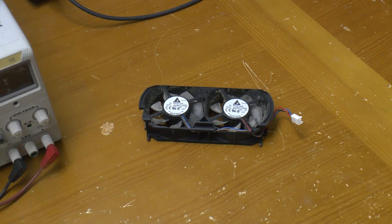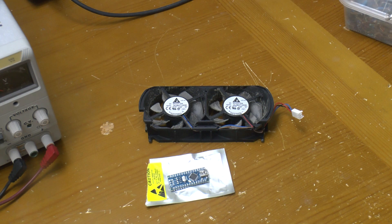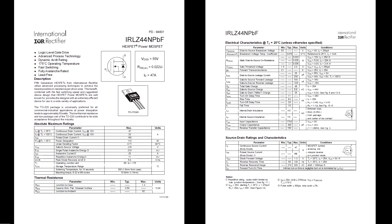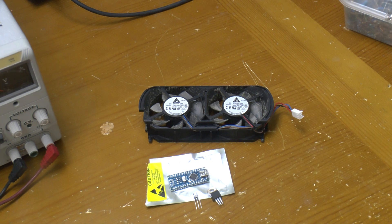So how am I going to control them? A computer would give some flexibility, so I've got a teeny tiny little computer — an Arduino Nano. Now, an Arduino can't drive a motor directly as it'll require far too much current; they can only kick out about 40 milliamps per pin. You can easily drive a MOSFET though. I've got quite a few IRFZ44s knocking about that'll do the job. An IRLZ44 would be better as its gate voltage is designed for connecting to logic level stuff such as an Arduino, but I'm not pulling a lot of current through so hopefully this will do — and it will save me actually buying some. For temperature sensing, I'm just going to use one of these bog standard 2N3904 transistors.